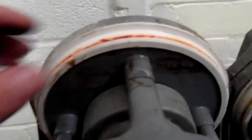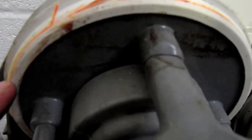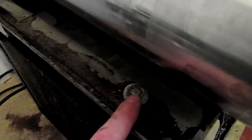Looking at the condition of the rear seals as well, again you can see that we've got a lot of old, now hard, syrup still stuck onto the seals. This is basically through not cleaning them. As you can see from here as well, we've got the contactors which connect to the tanks that sit on the top of the machine, and these have also gone flat, and the contactors are starting to corrode on top. This is just through shorting over a period of time with them getting wet from the syrup that's been leaking out of the machine.